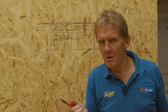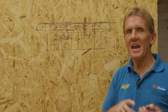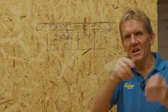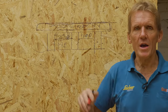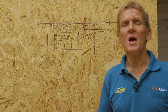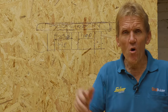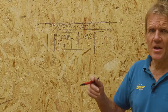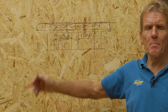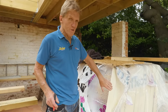If we've got say a 225mm joist and we're going to put 120mm of insulation in there, you can see we've still got a clear 100mm space to ventilate all the way through. We need a minimum of 50mm, so 100mm is good. We still need a through flow of air into that space, and if we do that we can clear the moisture as it condenses — a nice draft going through there will blow that moisture away, and on a warm day it will evaporate too. I have a friend who bought a house four years ago with a cold roof in this situation. They didn't ventilate the void, and within four years the whole thing had rotted — the joists, the OSB, the whole thing had just turned to mush. The whole roof had to be stripped off and renewed, and this time they put ventilation in.